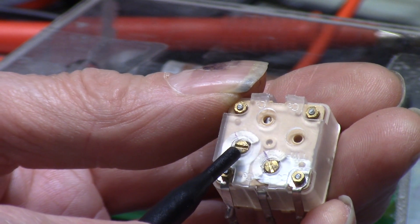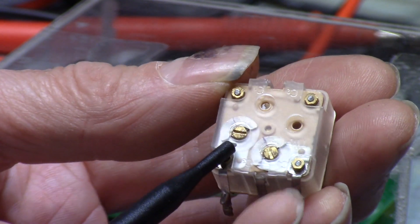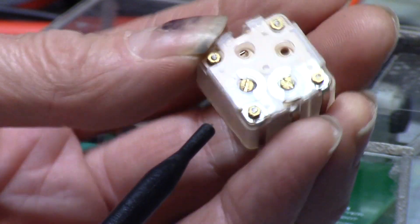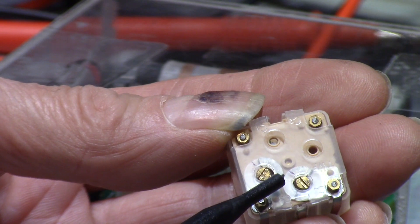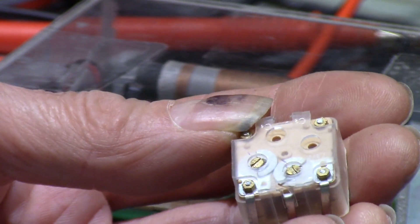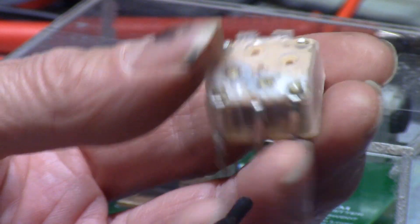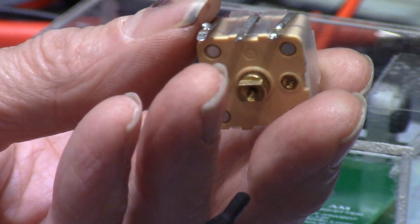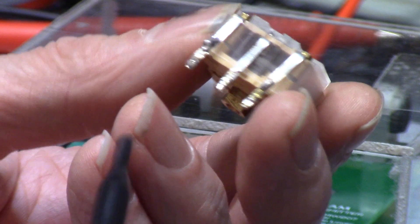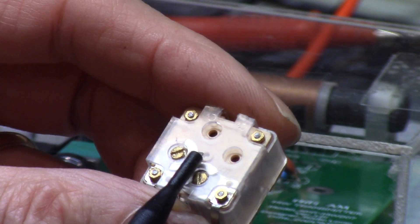I was thinking the metal dust was the culprit. I also think the tuner may have been set so the plates were super close together, meaning any metal going between them would cause problems. I blasted some air in there to make sure I got everything out, put it back together, and it seemed to work okay for a while — then it started misbehaving again.